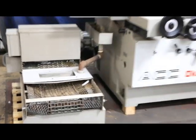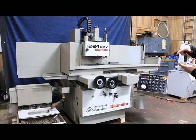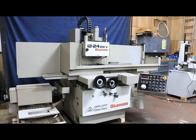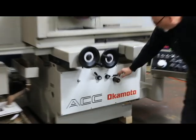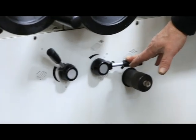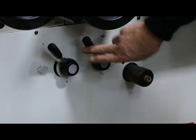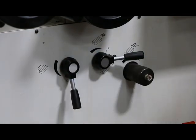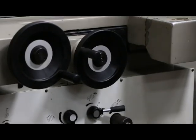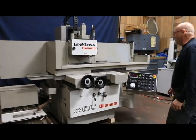This takes a 14-inch diameter grinding wheel with a 5-inch bore on the inside. Down here you have controls to adjust your incremental step of your saddle, to turn your saddle on for that incremental step or up for continuous. You have your control for the table going back and forth, and to regulate the speed of the dresser diamond going over the wheel, you have a little valve for that.